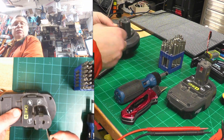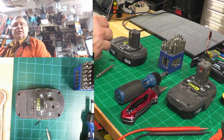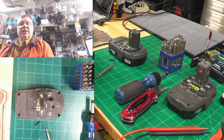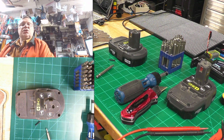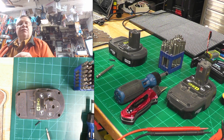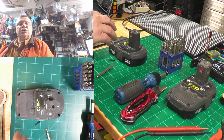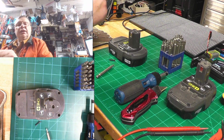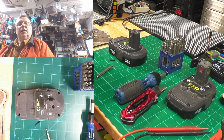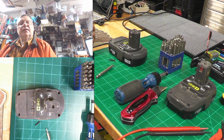What I did is I didn't even put the screws back in yet and I stuck it in the charger and it started charging — so you're done. Once it starts charging, you're done. If not, repeat the process. If the batteries are so bad that they won't take that little charge and don't retain at least around 2.5 volts, the charger will never be allowed to charge them. Make sure each battery is charged up to at least 2.5 to 3 volts. Thanks for watching — please like and subscribe.